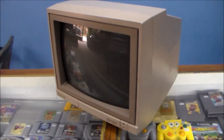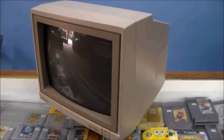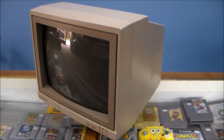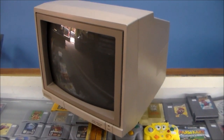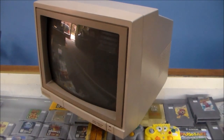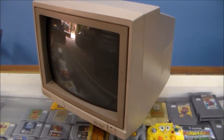I haven't plugged it in yet, but it comes up with lines through the screen, is how he described it, which to me kind of sounds like the flyback's up too high or something like that. I don't know anything about these monitors, but I do know a little bit about repairing TVs and arcade monitors because we've done hundreds and hundreds of monitors here at the shop. So we're going to look at it and see if we can fix it for him. First thing I'm going to do is turn it on and see what it does, find an old system to provide a signal to it, and if the monitor's messed up, maybe we can crack it open and see what's inside.